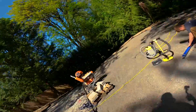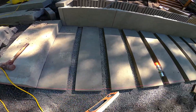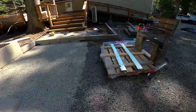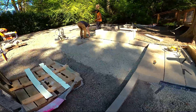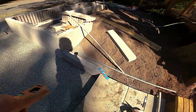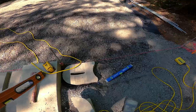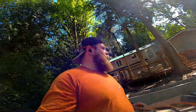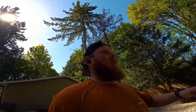Today's main focus has been getting our main pathway of pavers laid. Seth and Bobby have been doing a great job. We're doing a four-inch gap between these pavers — they're going to be filled with a black Mexican pebble. This is a Melville curb, like a six-inch tall curb; this back area is going to be bed space. One thing I really like is how we used Melville curb 90s, then get a break at the tread and pick it back up over here. It's a consistent theme broken up by other elements — a really cool design choice. Once the pavers are in and the turf's in, it's going to partially cover the curb, and I think having just that little bit of character poking out here and there is going to really make this job pop.